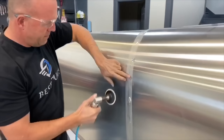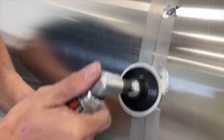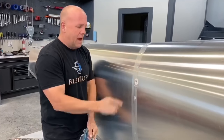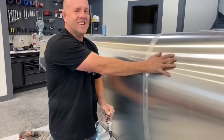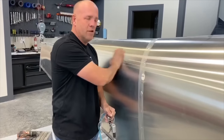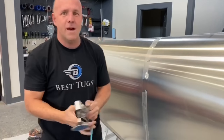Most of the rivet head is going to stay. If you look close you can see the ground divot - sand around the edge and most of that head is still on there. So when I put the bondo on, I won't bump up and down over these rivet heads. Of course you should never do this on an aluminum airplane and destroy the integrity, but to make a mold for carbon fiber with aluminum, this is the only way to go. So we pull the tape off, bondo it up, about to work.